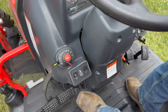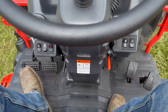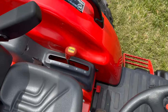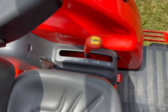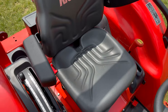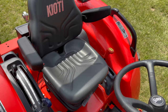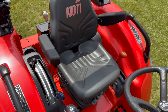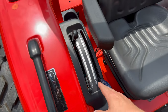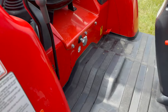There is a telescoping and tilt feature for the steering wheel activated by a button. The tractor has an emergency/parking brake and split pedals that you can disengage independently. The hydrostatic transmission has Low, Medium, and High ranges with neutral in between each. The seat is adjustable; this model does not come with armrests standard, but we added them since they're helpful for loader work.